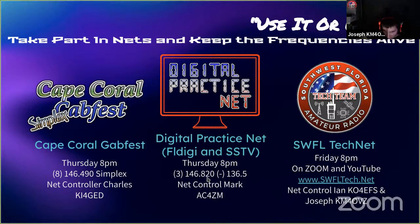Something to note, though, about this 820 repeater. They keep saying there's external interference. There's something up with that repeater. Sometimes your pictures will come out really broken or distorted because the repeater has this awful screechy noise that comes out of it sometimes. And it causes problems for the slow scan TV. FLDigi seems to usually make it through okay, but that's probably just because it's a quicker transmission.